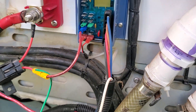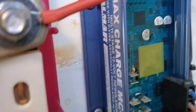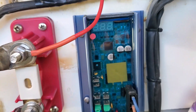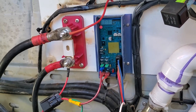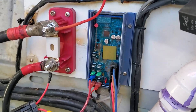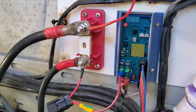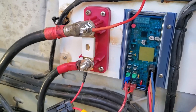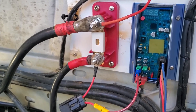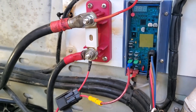Here is the controller for the alternator — the Balmar Max Charge MC618. You definitely need this with the alternator. If you're going to have dual engines, like we do on this catamaran, you need what's called a center fielder, which connects to both controllers and controls them at the same time to prevent conflicts or overheating. I've already run the wires from the other side. I've test run this, but we can't — or really shouldn't — run both motors without that center fielder.